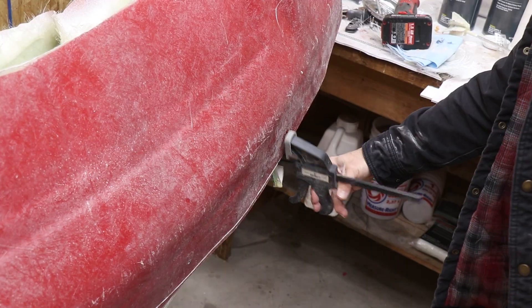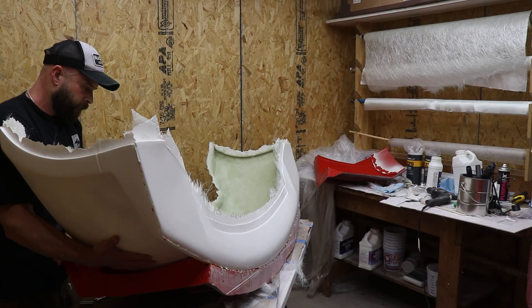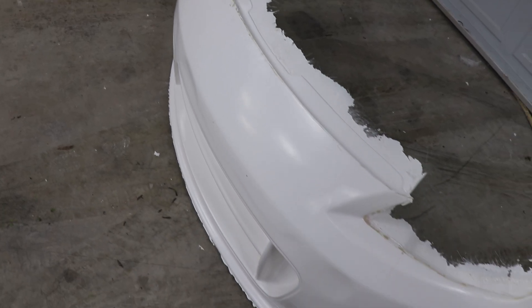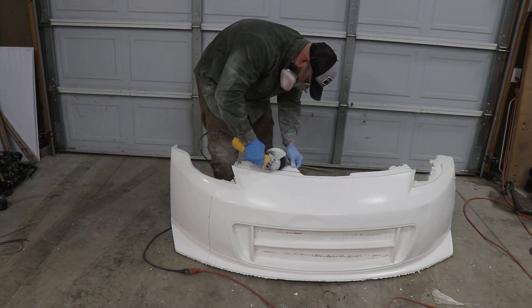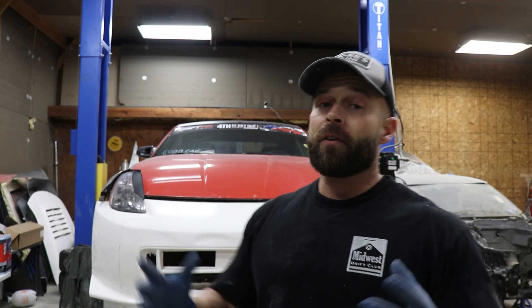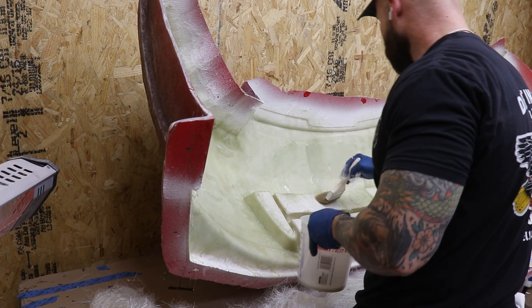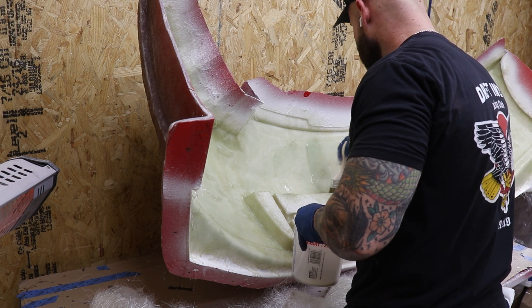After applying additional reinforcements with fiberglass cloth and waxed resin, we allowed this part to cure for three days before removing the clamps and pulling the part from the mold. It actually came out quite easily because of the chemical release from Easy Composites — I really recommend using that for all molds. While trimming the bumper, I noticed there was absolutely no alligatoring with the gel coat, which was purely because I laid the gel coat on so thick, as opposed to previous attempts where the gel coat was too thin. However, the bumper did warp in some areas, likely from the layup schedule of allowing the first layer to cure before applying the other layers, and possibly being too resin rich, causing an exotherm that was a little too hot.